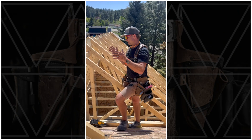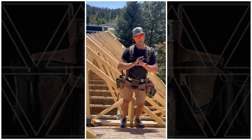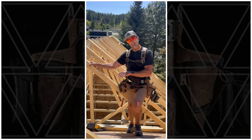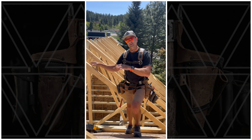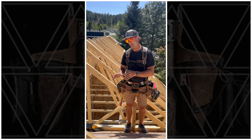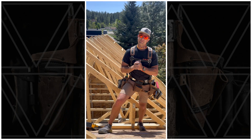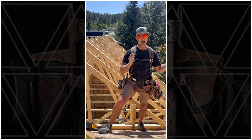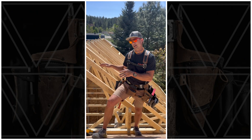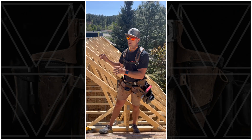Just finishing off putting in valley sets over this roof. For starters I always sheet the plane before I put my valley set on. A lot of guys put them right on top of the trusses — that's how they're typically designed geometrically — but then you have to block all the intersections and have nowhere to walk. I find sheeting first and then making an adjustment to their layout is the best, safest, fastest, strongest way to do it. Majorly crucial detail: follow the layout from your truss company. The trusses have to go where they lay them out to be or none of this works. If you lay it out properly per their drawing and do the math correctly, putting these together is a joy. If you take liberties, you'll be fighting it.